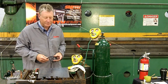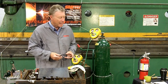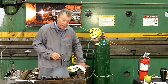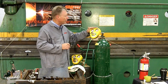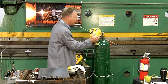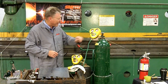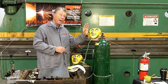As we begin, always use equipment in good repair. Today we're using the Smith Equipment brand. Our equipment is assembled already, but a few things you need to know for sure. Cylinders are always secure — you notice a chain around these. Before an oxygen regulator is attached to a cylinder, open this valve to blow out any dirt or debris that might be in that valve connection. Attach the regulator securely — that's a right-hand connection. Notice that the regulator is placed in somewhat of an upward direction.